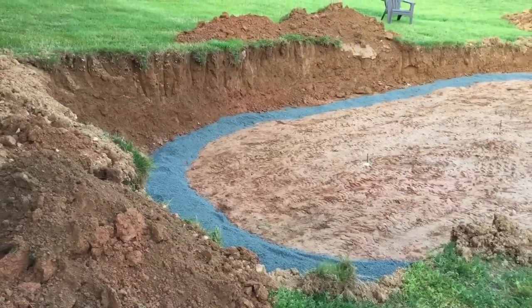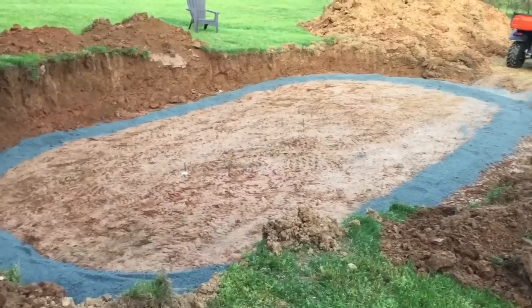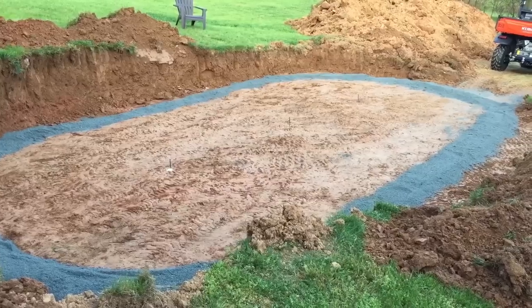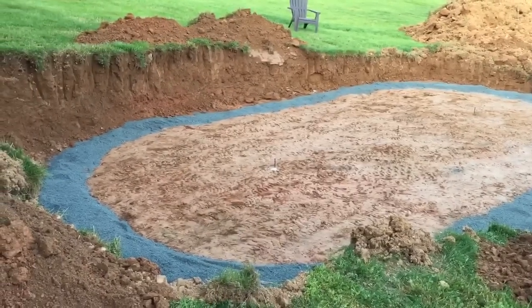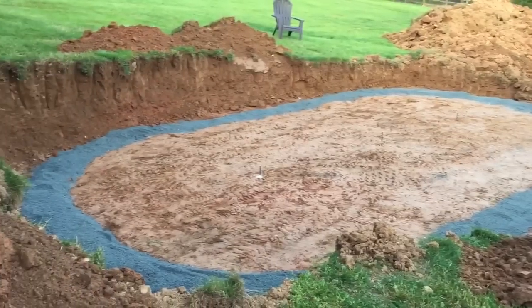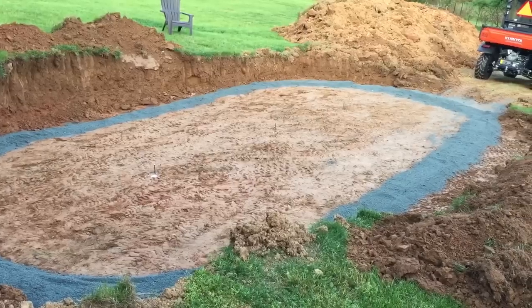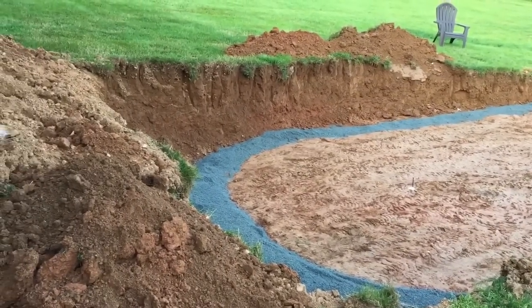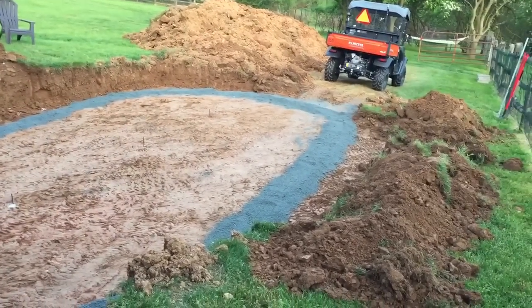All right, this is the end of day 2. Been a good part of today just working on fine-tuning, getting this as level as I can be. Obviously putting a pool in, you don't have a whole lot of tolerance there, so you have to make sure it's as level as can be. And pretty much with the rotary laser level going all the way around, as you can see the crushed stone there, I'm right on point there. I would say I'm a half inch, if not less, all the way around level wise. So from this point on, I will start erecting the frame and go from there. Got a lot done. See you soon.